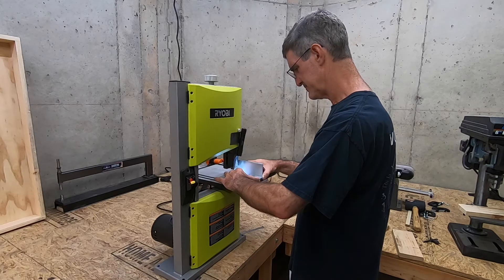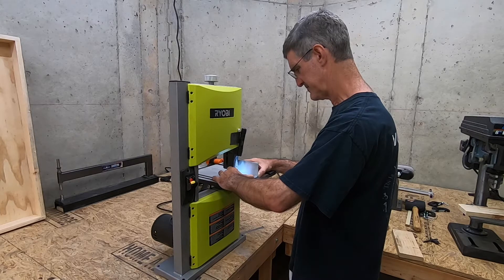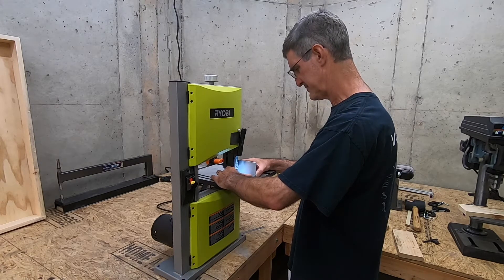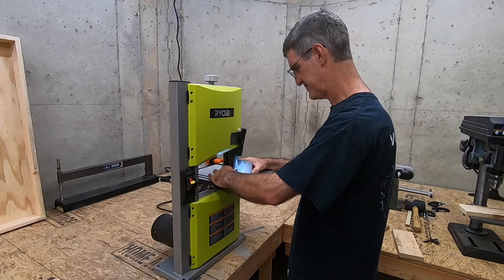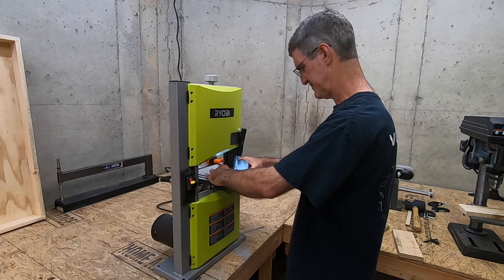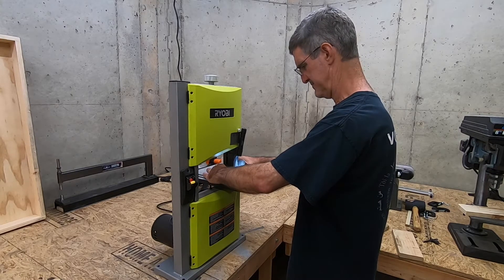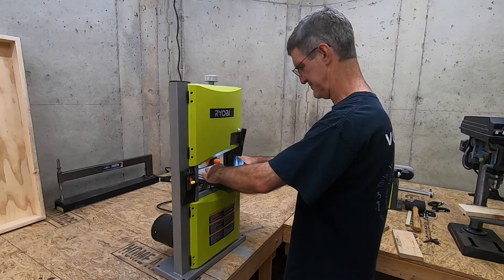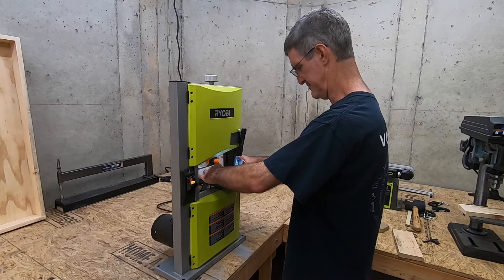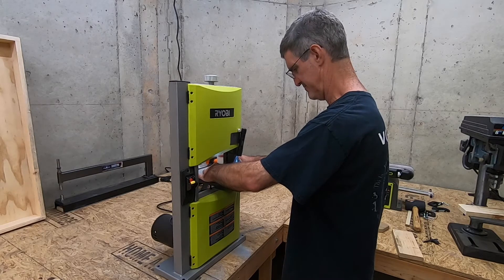I forgot to mention - that's masking tape on the bottom just to keep from scratching it on the table of the saw. Also, you definitely want to cut on the waste side of the line and leave yourself enough excess to file down and smooth up the edge. I've got a 24 tooth-per-inch band on that saw - the finest I could find - and it still leaves a pretty jagged edge that you'll want to clean up. It got pretty hot as I went along; I had to pause a couple of times. It took about two minutes to go five inches, so about two and a half inches per minute.